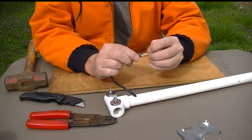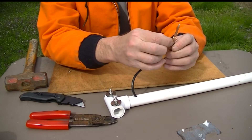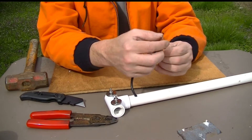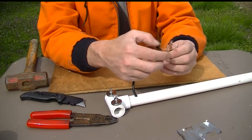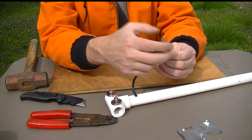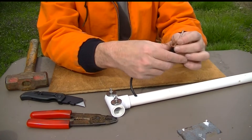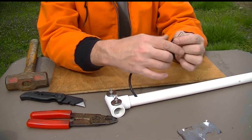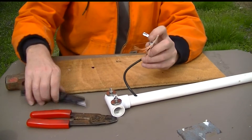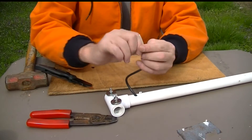Slide the braid down so that you get a little push at the bottom and pick out the strands. Another way you can do this is to push the center conductor out the bottom, but that puts a lot of stress on the center conductor, especially if you have a solid one. This one is braided — I just like to push them out. Make sure you get them all so that you don't have a short. Cut that aluminum inner shield off and twist them up.